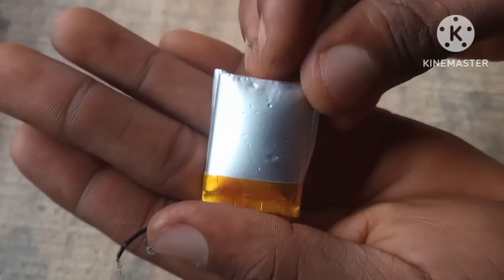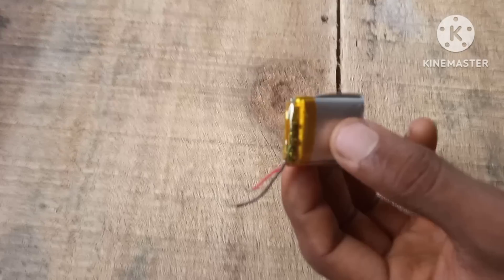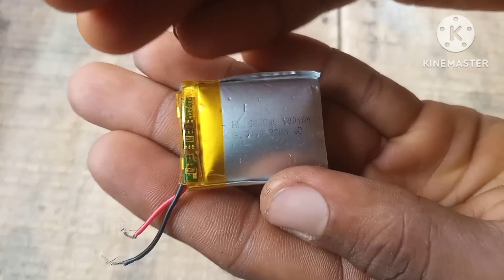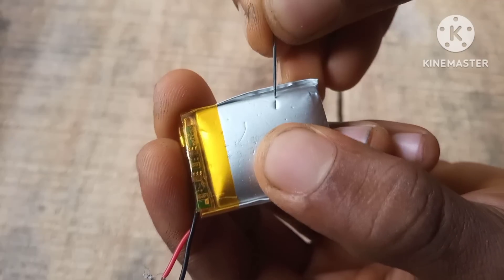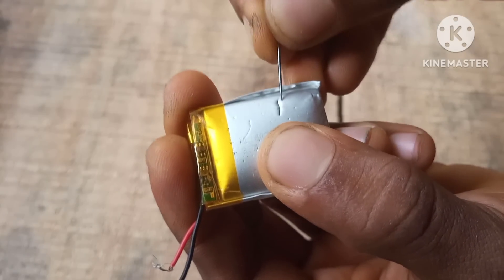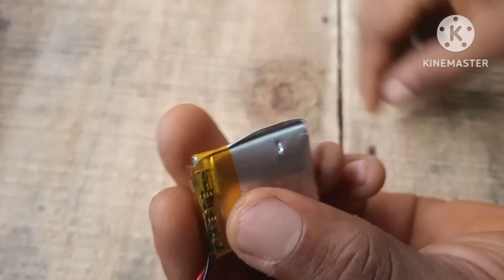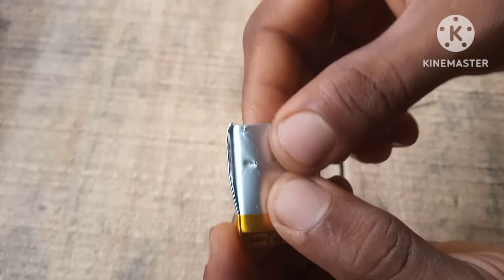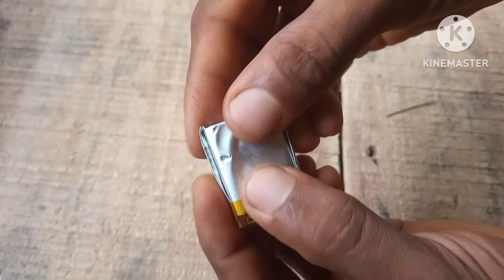Let's move on to the next battery. This is still a swollen LiPo battery and it has a BMS on it. The BMS didn't really do its job here by stopping the battery from overcharging. Not all BMS units are efficient. This particular BMS will cut off if the battery is over-discharged or if there's a short on the battery — though most BMS units do more than that.